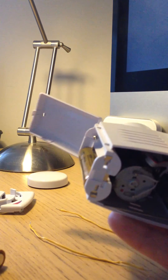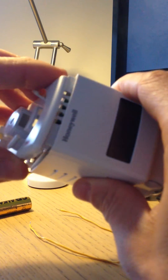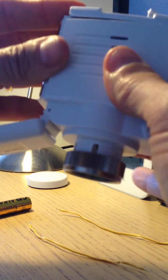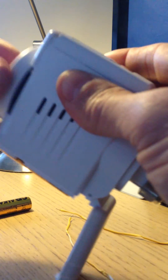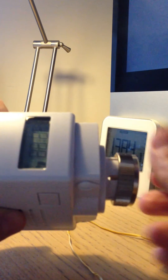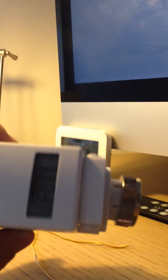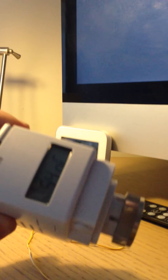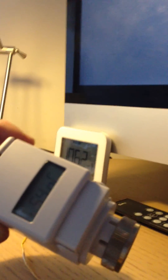I'm going to take the batteries out so I can reclip the unit back together — which goes in bottom first and then clicks in place. And we should have a unit without an E3 error. Thank you, I hope it helps. As I say, I've had 10 units replaced out of an 18-unit system, using all 8 zones, where they're slave or masters. I'm getting E3 errors once every 3 weeks I guess over 8 months, so I really do hope that this helps in some small way. Thank you.